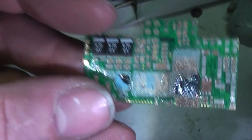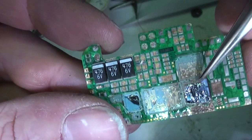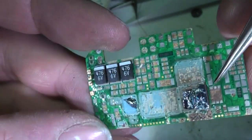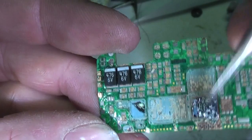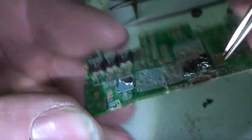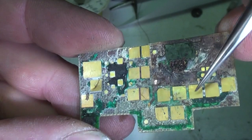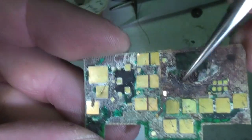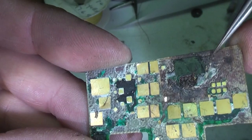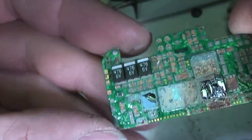Right, so here's what's left of the PCB after my various attempts to strip it off using a mixture of chemicals and heat. There's still one chip left there. It's too broken up to be worth trying to take off to look at. So on this side you've got these three pretty big chips, and a slightly smaller one here. Most of the discretes are on this side. These small devices here are discrete semiconductors, and some of these are the MOSFET type devices. And there's one very large chip here, which I think was that memory device. There's a couple of medium-sized ones here, but pretty much every bit of silicon on this looks like it's custom.